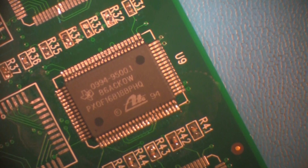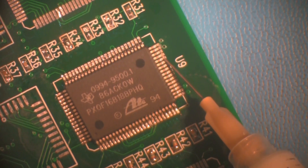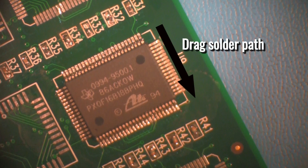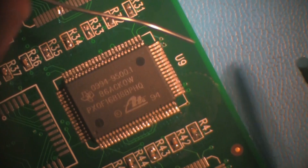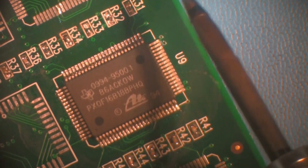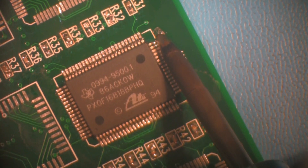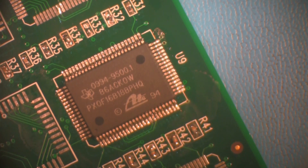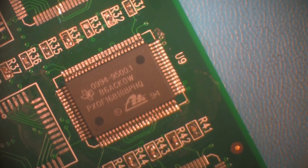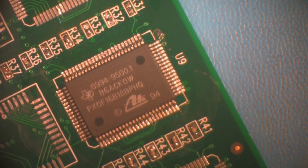The third method that will be demonstrated is known as drag soldering. Reorient the board to access the next side of the component, ensuring that the board is in a position so the leads are perpendicular to the direction of the drag path. Using a single-sided chisel or similar tip, apply just enough solder to cover the face of the iron. If the tip has a concave pocket, the cup will need to be filled with enough solder to form a small bubble. Place the iron at the end of the row of leads with the face of the iron parallel to the board surface. In a smooth, steady motion, slide the iron along the row of leads, allowing the solder to transfer to each lead in the row. Be sure not to apply any pressure on the leads of the component or there may be a risk of bending or otherwise damaging the leads.